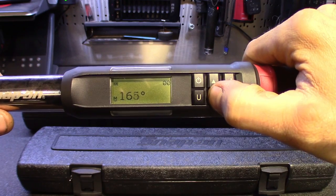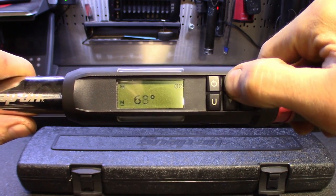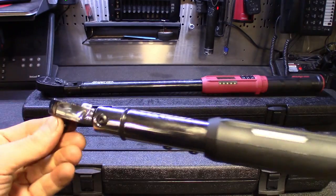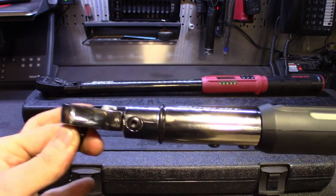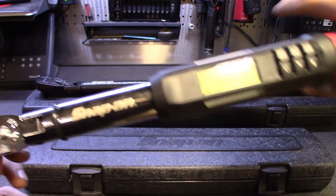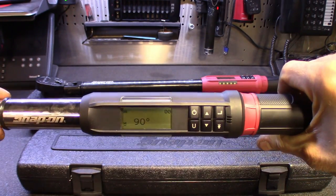Same thing - you scroll down, hold it and it goes faster. You've got to sit and wait, but it goes faster as you hold it and eventually starts skipping by 10. I'm going to take this up to 90 - that's what I use most often. Say you're going to torque-angle it and you're limited on room, only getting maybe 15 degrees. As long as you've got a socket on there and it feels torque, it counts it. You go 15 degrees, it counts it; go back, it'll stay at whatever you were, and won't start again until that bolt starts to move. You've got to keep steady pressure on it while pulling down and it stays pretty accurate.